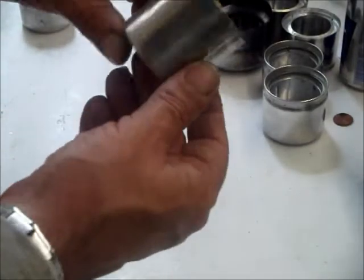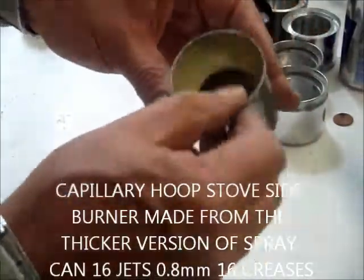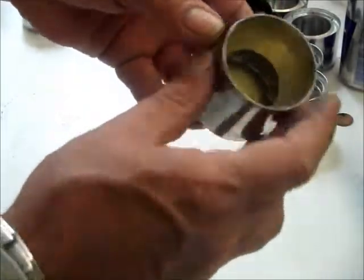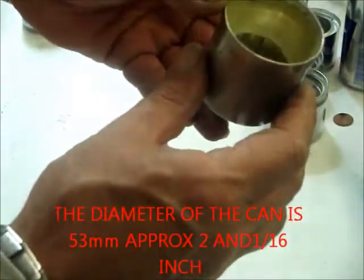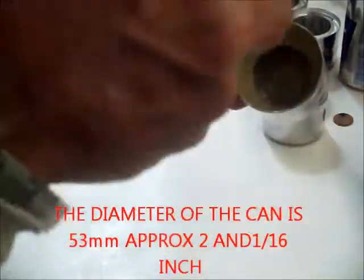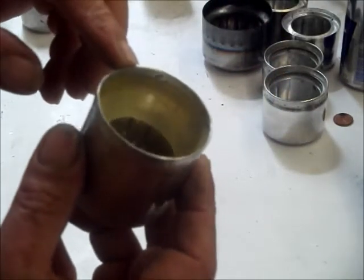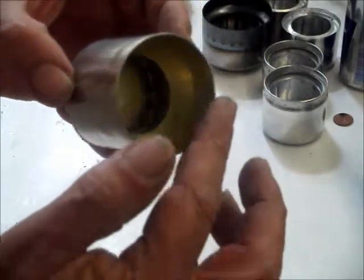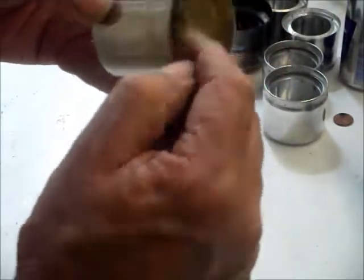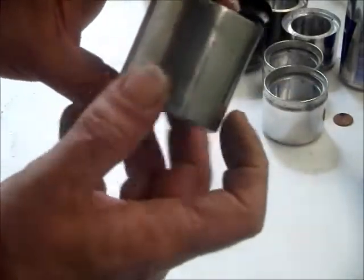Another example of the hoop stove — I had these large spray cans with strong aluminum. Unfortunately the neck I had available wasn't very long, so I had to cut it short. Instead of making it in the conventional manner, I managed to make it in the form of a hoop stove as well, and it works very well. Instead of having a round lip, I also managed to turn out the lip and flattened it down with a piece of pipe. This one is also a side burner and it burns very efficiently.